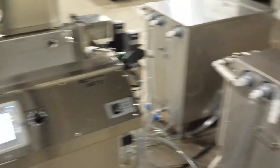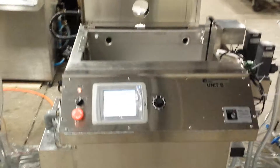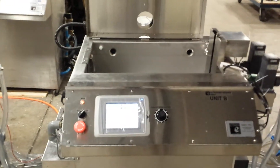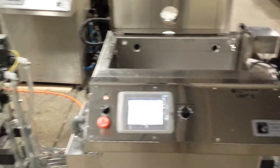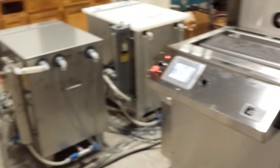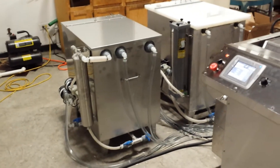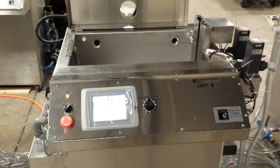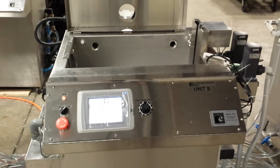The way the system works is upon activation of a cycle, the tank will fill with the first wet process — alkaline detergent — so it'll pump from tank number one, alkaline, into the process unit. Ultrasonics will commence when the tank is full to do a wash of your parts with alkaline detergent. Then the fluid will pump back into the alkaline tank.